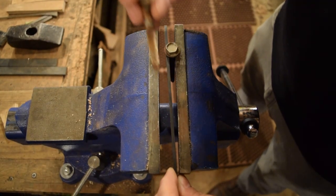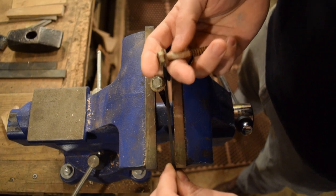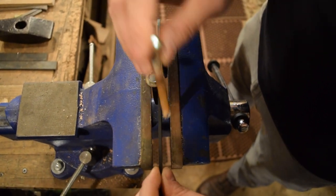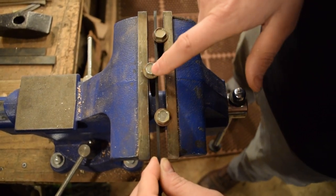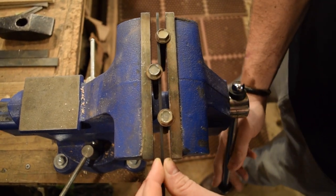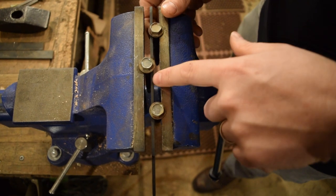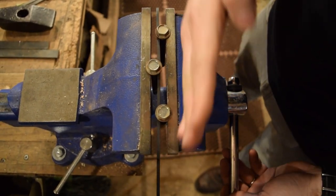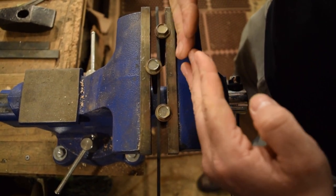Find three screws or three lag bolts. These are lag bolts, and they have a flat surface that's unthreaded close to the top. So that will sit against my blade. And basically, when you have three points of connection, your middle point is going to bend when you put pressure on your vise. So you just need to put this point of pressure wherever your bend is, and you want to tighten down just a little bit on your blade to get the blade to bend in the opposite direction, because you have to go past that bend to come back for it to stop in the middle.